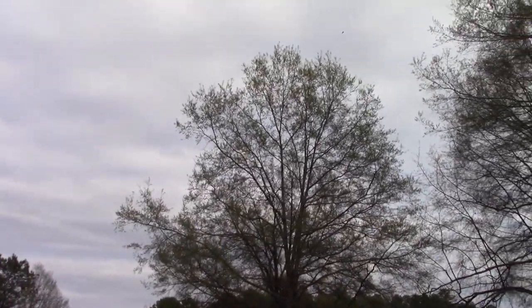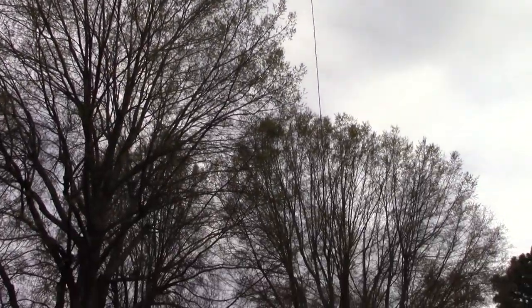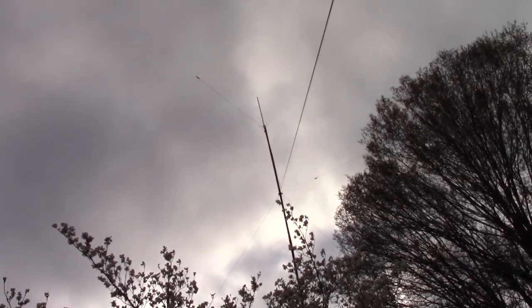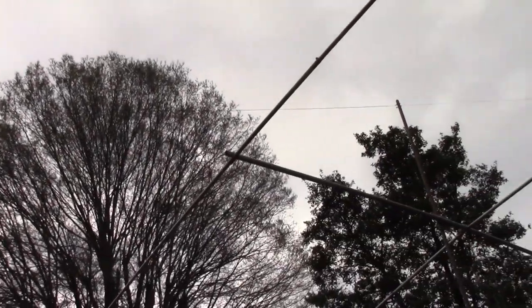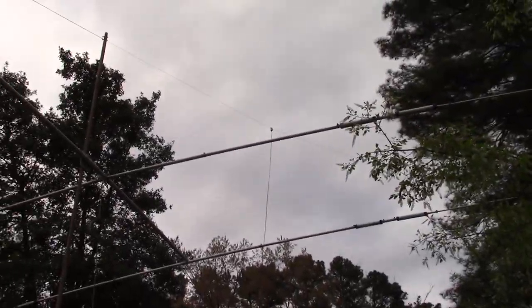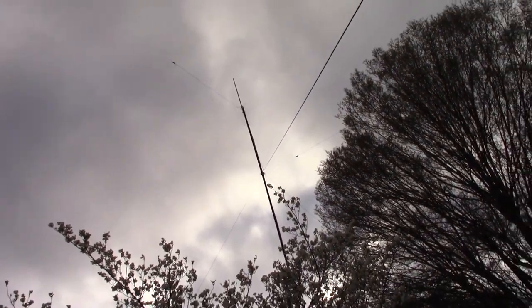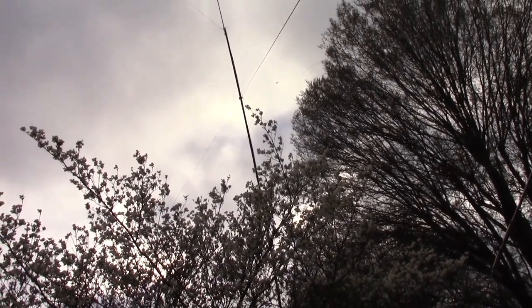I wasn't able to record pulling it up, but it's up there. Here's our balun box with the coax running down, and we're going to dress that out in a few minutes. That runs to our mast — this black wire here is a guy wire — and then our off-center fed dipole runs out here. You can see the balun. Those are the two HF antennas I've got mounted to the mast, so there's two antennas, a ground wire, and three guy wires coming off the mast.